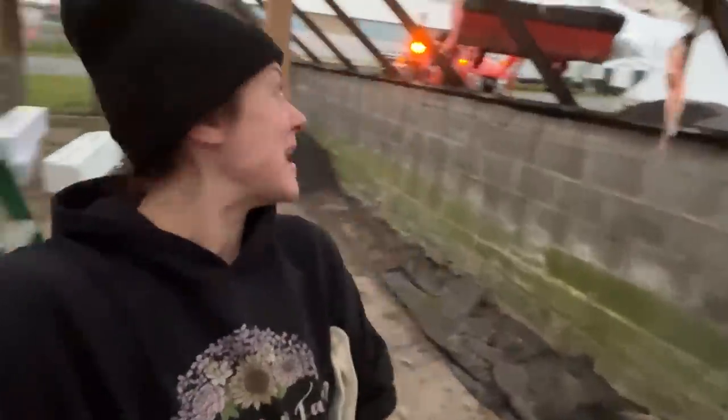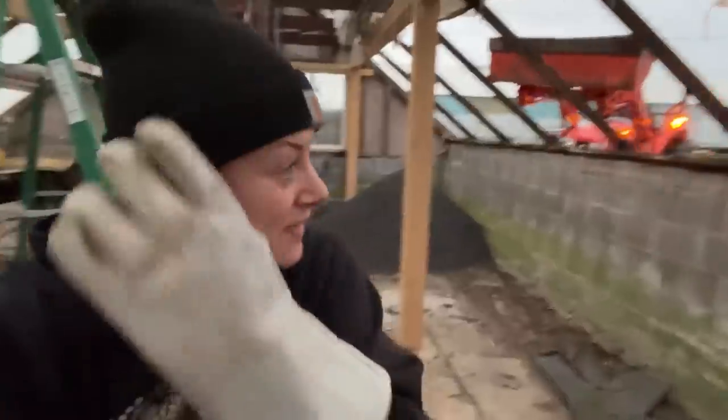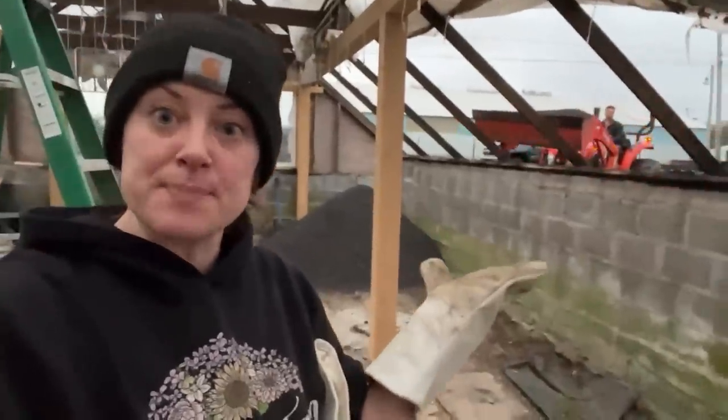As you can see, Brad is actively dumping buckets inside. We're able to basically fill up to the line, really. That's when the ground stops, and then the cinder blocks. We don't want to put too much pressure up against the cinder blocks. So Brad said we can safely put up to the end of the green blocks with the stone, and then he'll move down along the line.